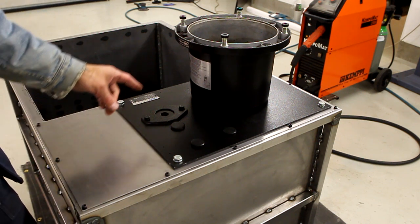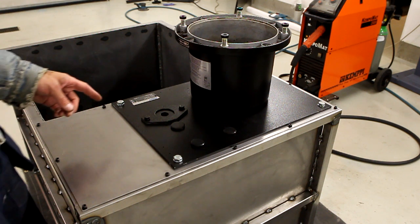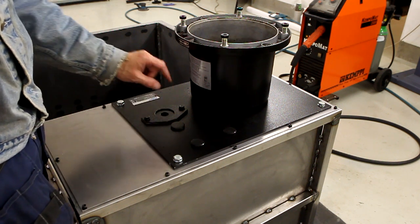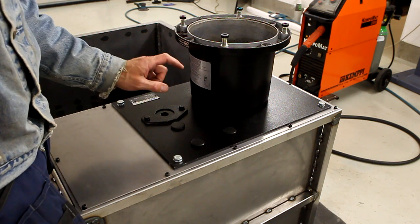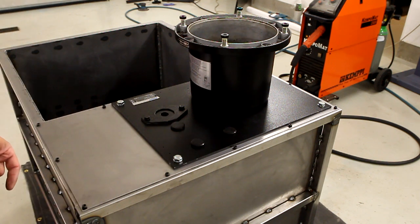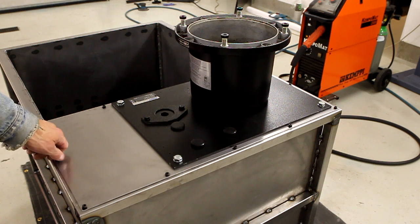Later I need to make the piping — maybe pipe is the correct term — from the pump up to here, and through the pressure relief valve, and through a coupling that goes to the machine. Down from the pressure relief, down through one of these, and the return from the coolant — the sump pump in the machine — which will be the original pump.